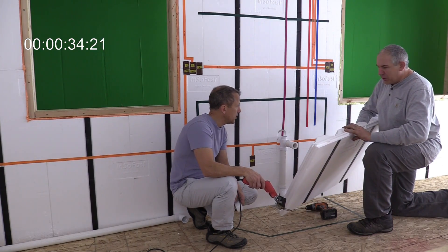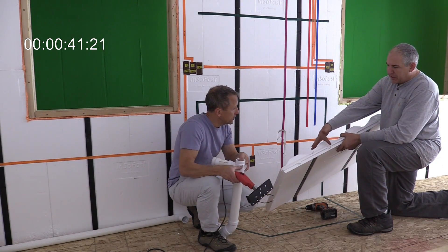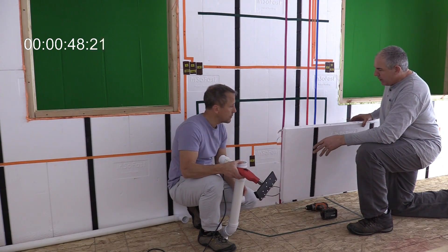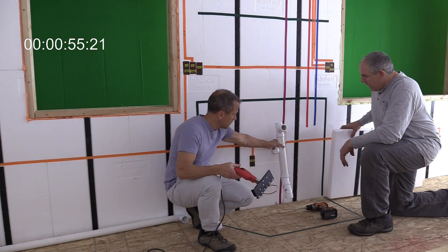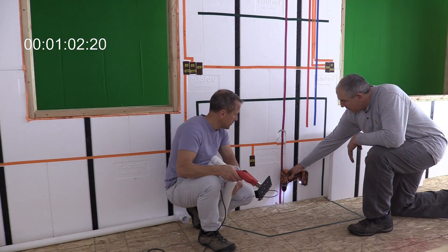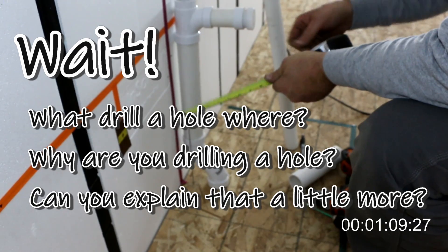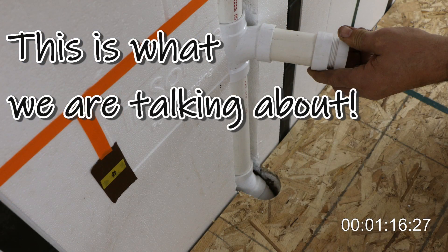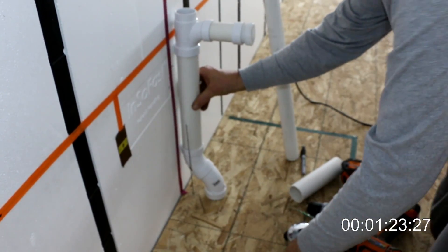One of the things with plumbing is you first want to decide where your fixtures will go. The pipes have been located so they go in the thick section of the foam. A two-inch pipe will run into the foam from the sink and the waste pipes. After determining plumbing locations, it's smart to drill a reference hole through the floor. The coupler is about two and a half inches for the two-inch pipe, so we'll be drilling the hole two and a half inches over.